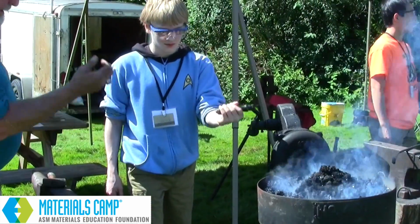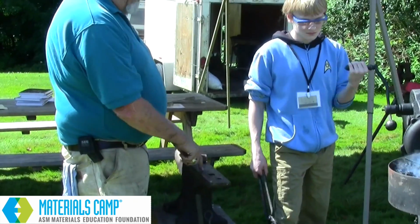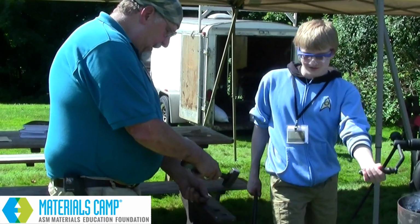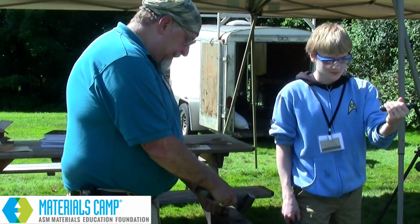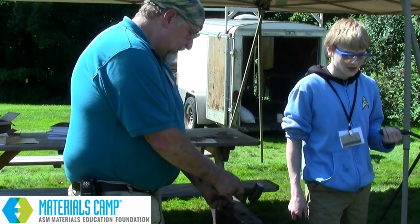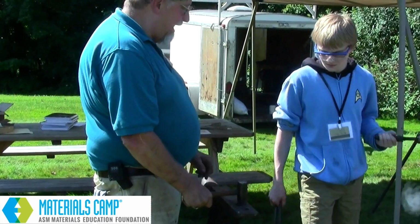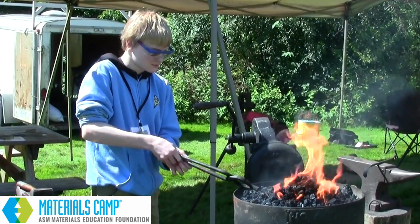When you pull it out of there, you've got to already be thinking, what are we going to do first? We're going to put a point on that piece. And you do that by hammering, angle your hammer. Okay, hit it once, turn it 90 degrees, hit it again. Turn it back. You don't go all the way around, because whatever you do on the top, the anvil's doing on the bottom. Pull your piece out, get a grip on it.